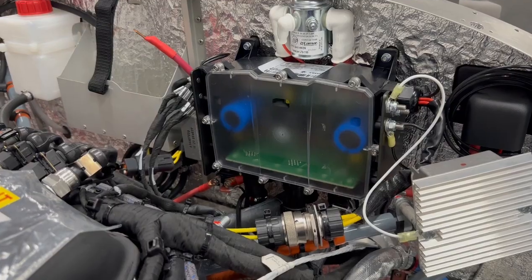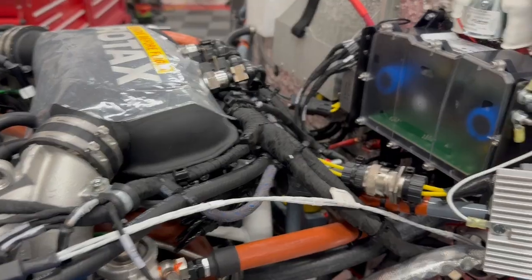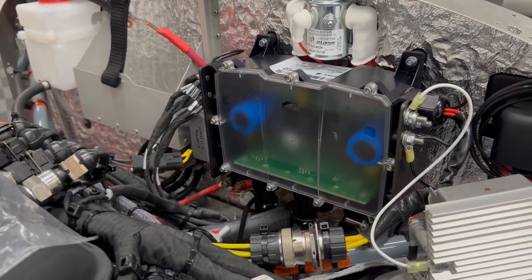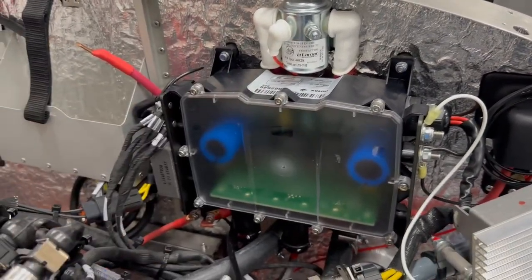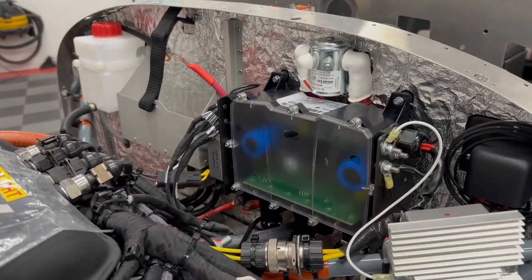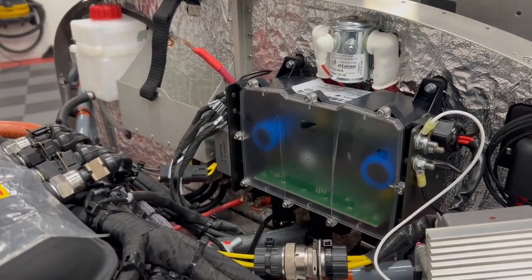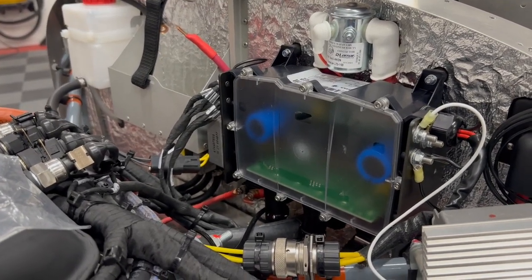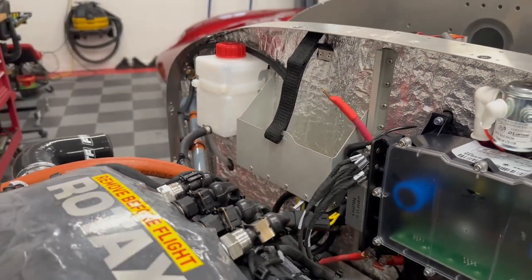The engine has two alternators, well actually they're generators, and in this box that current is rectified to DC, and there's two sides to it. This side is the engine side, it runs strictly the engine, and this side is for the airframe, it runs the whole airplane, avionics, etc. They are designed to fail over if there should ever be a generator failure, so they protect each other, and if both fail, it will fail over to the battery. The main shipboard battery is right here, obviously not installed yet.